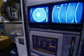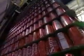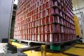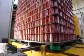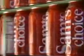The cans pass through a sophisticated vision system that photographs the inside of each can. Any can that doesn't meet standards, that has a bump or ink inside, for example, is automatically canned from the production line. They strap the finished cans onto a pallet. From here, they're shipped to the drink company, which fills them, then attaches the pull-tab cover.